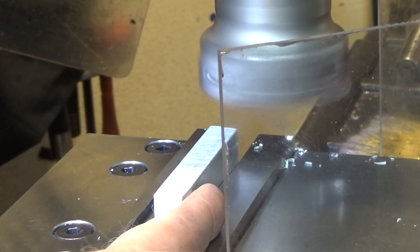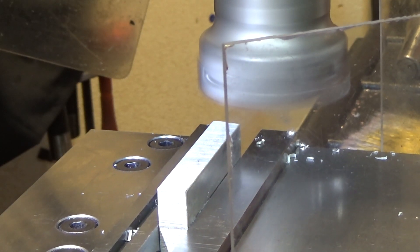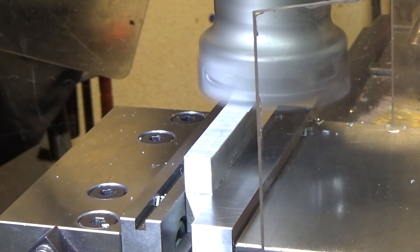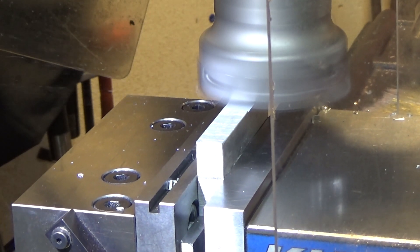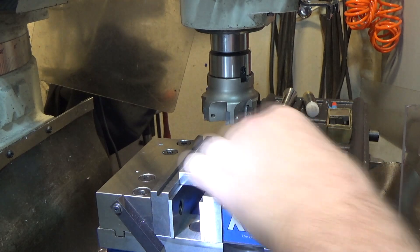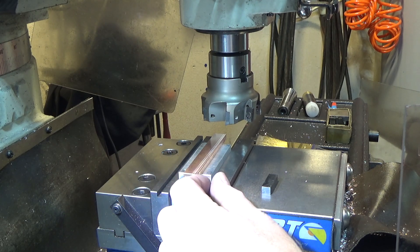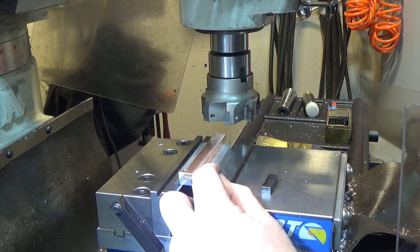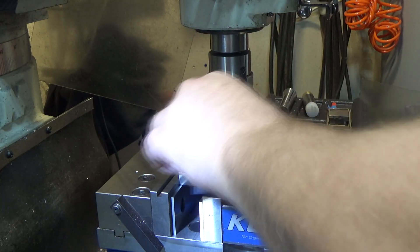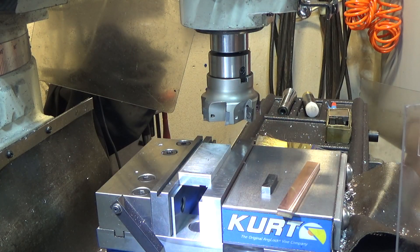In preparation, I've loaded up a piece of tooling plate. This side and this side are very parallel, so I squared up the bottom and now I'm squaring up the top — just taking a little material off. That'll make it easier to align the other part and allow the vise jaws to hold even pressure. I've got a scrap piece of tooling plate here — it's not long enough to support the copper all the way, but I'm hoping it'll be thick enough. Before I glue this down, I'm running one of my precision flat stones over the surface so it'll lie as flat as possible.